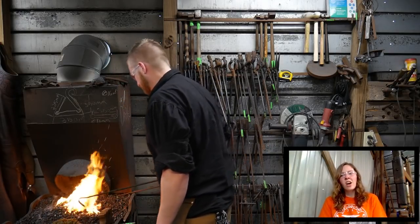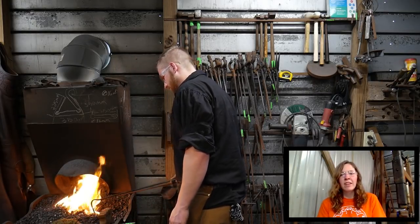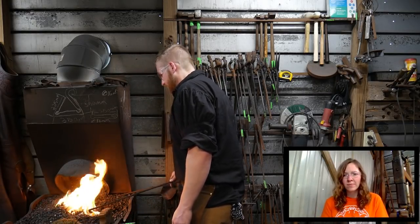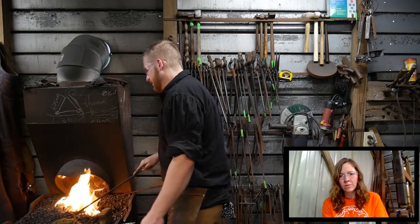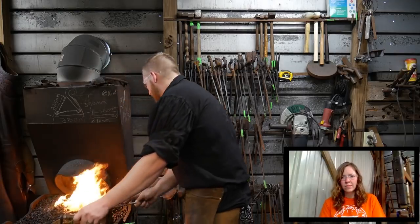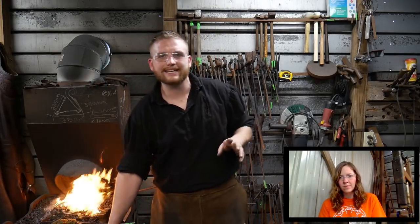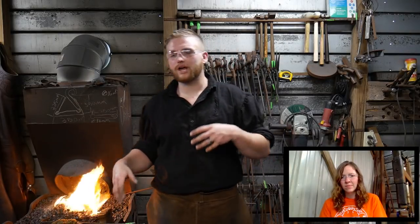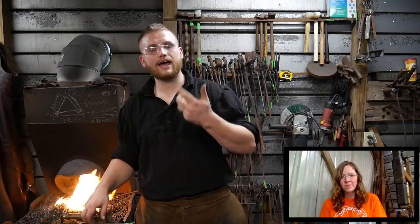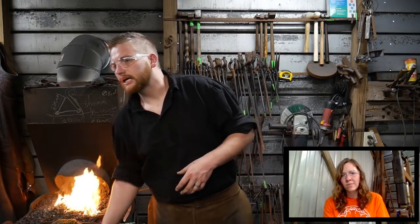John Tompkins says, they talk a lot about flux burning out gas forge brick lining. How does it affect the fire pot in a coal forge? Doesn't at all. Maybe before I say it doesn't at all, proper maintenance of your coal forge will not allow it to have a problem, so to speak. It won't wear out the cast iron.